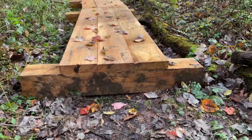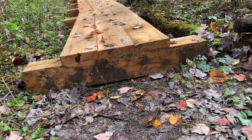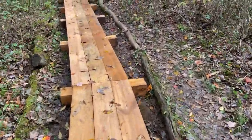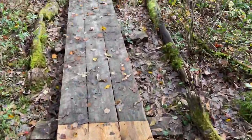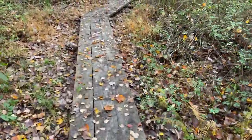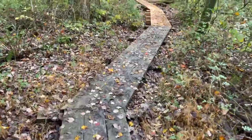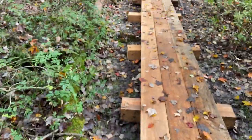So you have these 8x8 footings that just lay on the ground, and then planks on top about two inches thick — started about 12 feet long and cut down as needed. It's a very simple project. What's nice is this is a floating bridge, so when it gets boggy and the water fills up a little bit, you can actually feel these float a little, but they stay put. It's a woodcraft project because you can make these planks out of trees in the area — you just have to flatten two or three sides. You'd want to flatten the top, the bottom, and any side that's going to be butted up against another piece. When I was a kid that's what we made them out of — logs — just flattened three sides and butted them together.